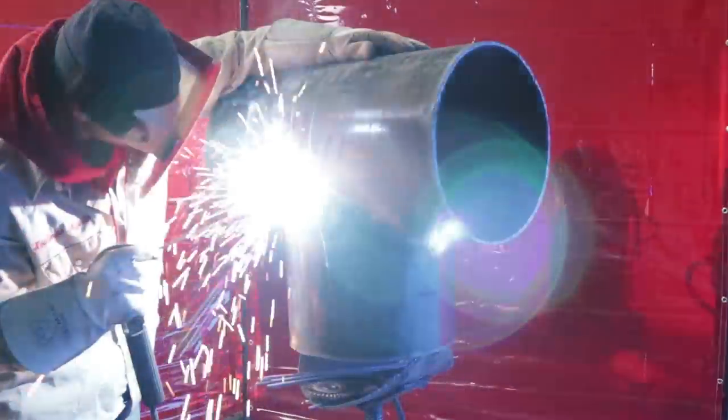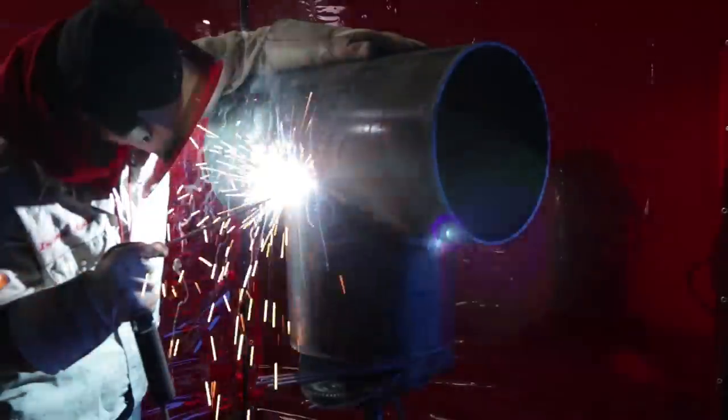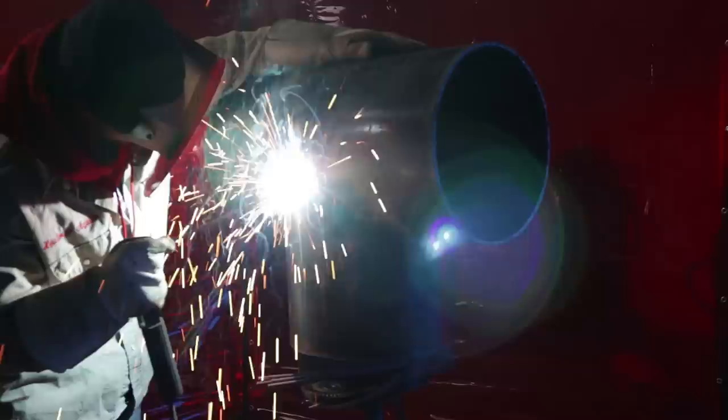All right, now for the hot pass, you still want to run it uphill a little bit, especially on the ears, okay? Not right where that bend's at. Don't start right there where the straps are going to be cut. Now here I'm running at third gear and 50. Same thing, whipping it the whole way through. Make sure they're tight whips, letting them stack next to each other really, really well. Make sure it's hitting both walls. You want to stitch it really, really well.